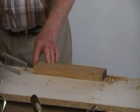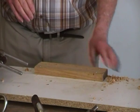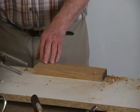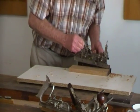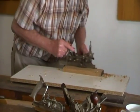Well, okay. Surely pushing it from this end right the way through, you must get tear out. You run the risk of busting up into the chunk that you do. And you start with no control. It cuts nicely, but it's harder. Yeah, but I think you run the risk of getting tear out, which ends up lowering your profile. And also you don't have control. Also, your fence is fully in touch with the side of the wood when you're starting in the middle. Where you start on the end, you tend to curve it.